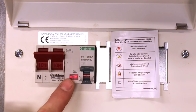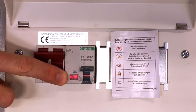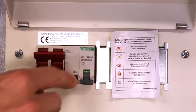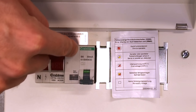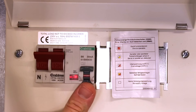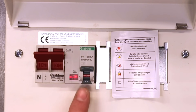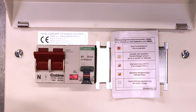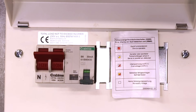This is the functional test for the arc fault detection device. The window is not only a light and indicator — it's also the test button. Pressing it with your finger causes the RCBO to trip off, operating through the keyway we lined up carefully earlier. It works exactly like the test button on the RCBO: pressing it trips the RCBO off as normal, and once the mechanism operates, it disconnects the circuit and completes its journey to the off position.